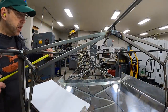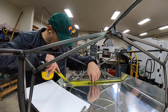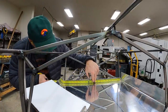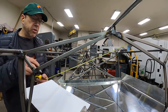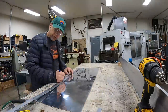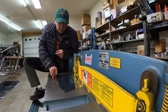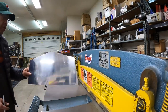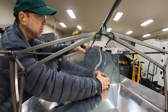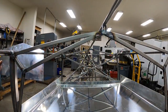I'm not sure anybody would want to watch all this, but this is pretty much what I do. I've got to fit a piece in between here — 20 and three-quarter at the bottom. I'll just kind of make a little sketch. So I've got my shape. What I'll end up doing is putting a couple nut plates here and here, and the next thing I'm going to do is actually break this in my brake, and I'll show you why.